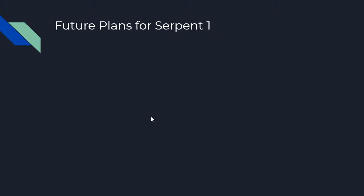So our future plans for Serpent 1, we are going to eventually start flying different types of motors on it. Currently we're flying 3 Estes E16-4 motors on the vehicle, and we plan to go to G20s, I'm pretty sure. We're planning on potentially flying 3 of those, most likely not. But also the tower, as we call it, is a 3-engine 3D printed, I guess tower. Cylinder with slots for the engines to go in, that will have 2 more changes made. So we're going to actually have a 2 engine and a 1 engine variant for the Serpent 1. So we are looking forward to that.